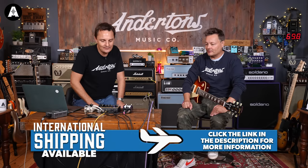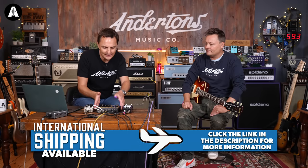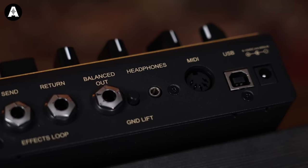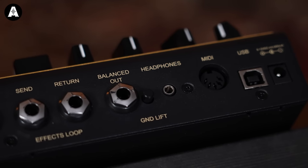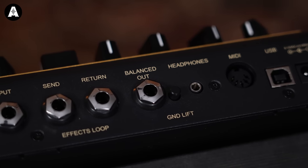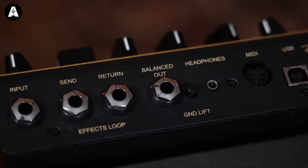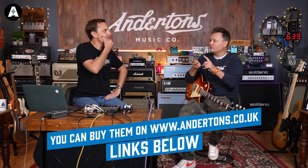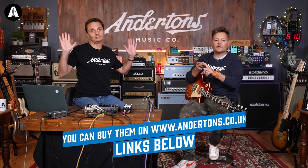Did it come with its power supply? Yeah, it's a world power supply. I think it's quite power hungry. That's the only thing, I suppose, a slight criticism: it'll work off anything from 9 to 12 volts, but it does need 800 milliamps. So a lot of those multi-supplies aren't going to cope. But can you do a dual, like a double one that goes out and you get double milliamps out of it? Yes, you can. You can do a current doubler as well as a voltage doubler. Links below for that, whatever I said. I bear no responsibility for any electrical advice Peter's given.